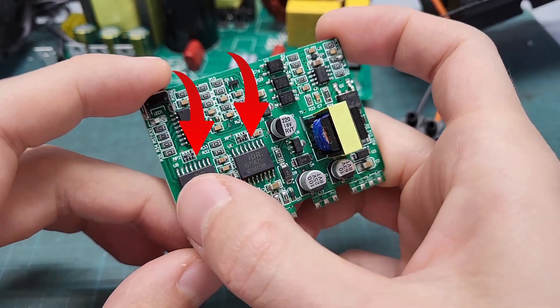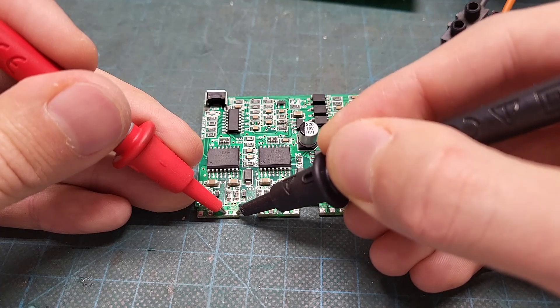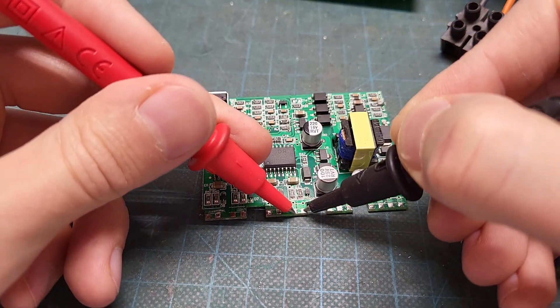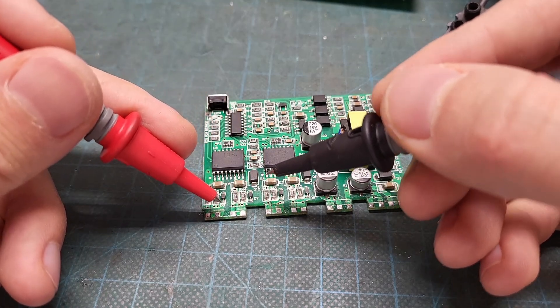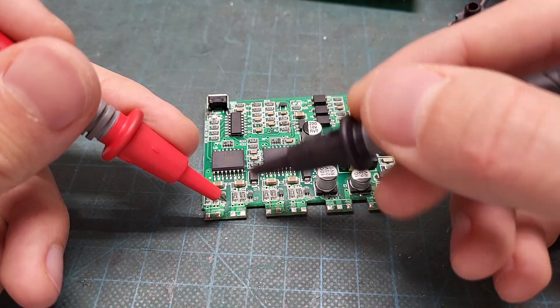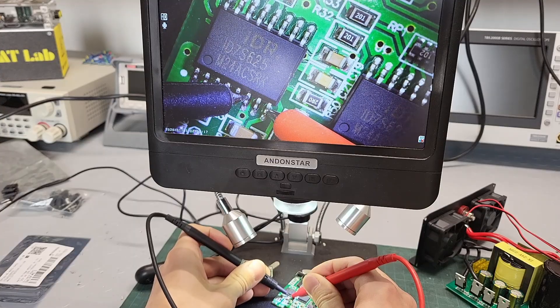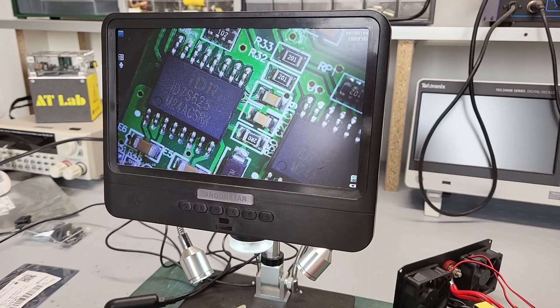There's a power section for auxiliary voltages, but the key components are these two gate drivers, and one of them has likely shorted out. I test the output and right away — as I probe it — one is definitely shorted. The others are fortunately open circuits, so they're fine. This is the faulty driver. I put the tiny board under the microscope and yep, three pins of the chip are completely shorted — it's the gate driver for one of the IGBTs.